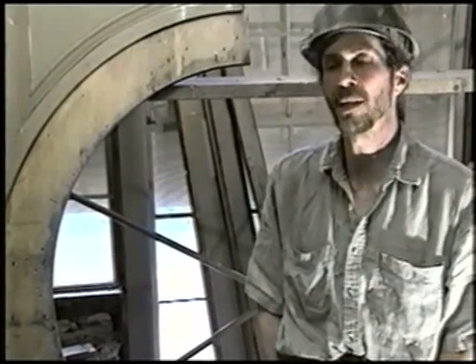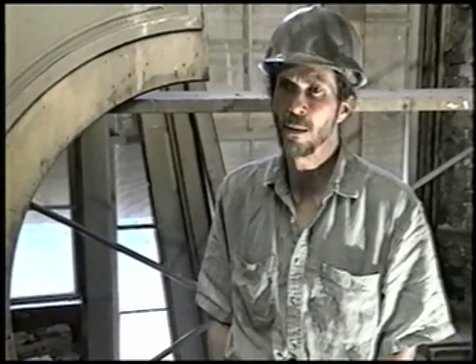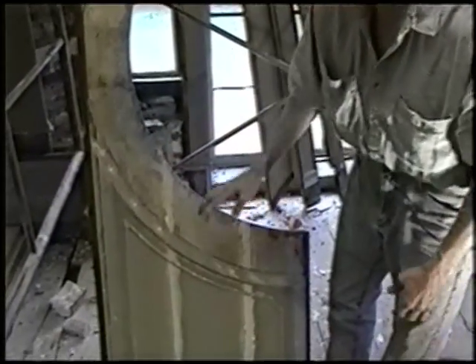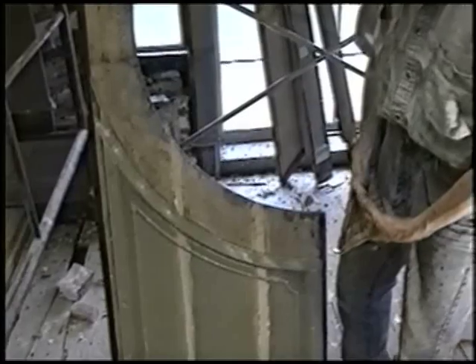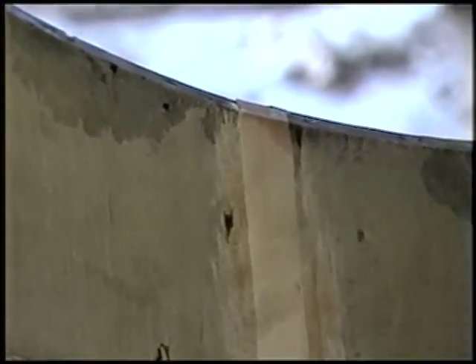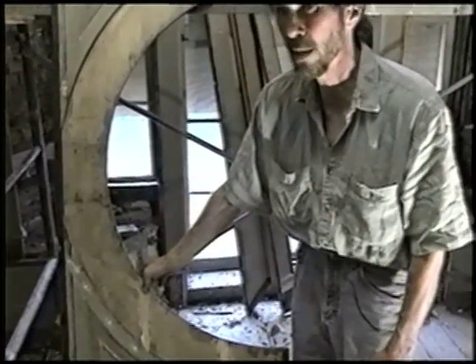Here we are back at the McClellan house. We're on the second floor in the grand hallway, and we are reinstalling the Palladian window trim parts which have been out at the shop for many weeks now. Basically it's just a very large board with trim pieces attached over it. It had to undergo chemical processes as well, and where the board shrank it produced large cracks. Those had to be filled with solid patches, or what are called Dutchman.